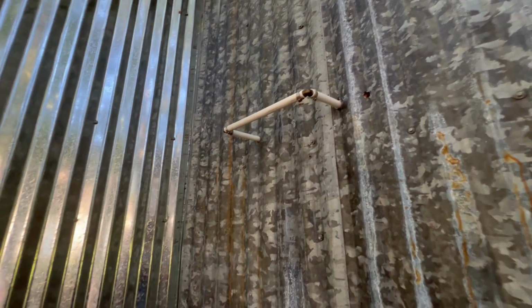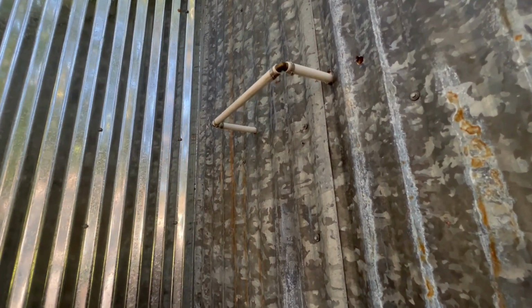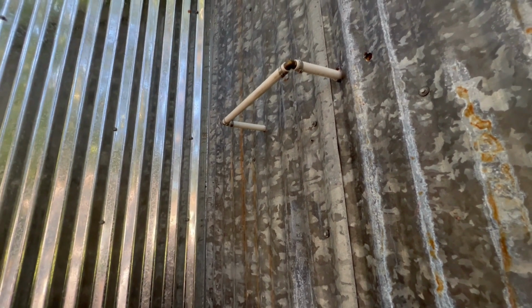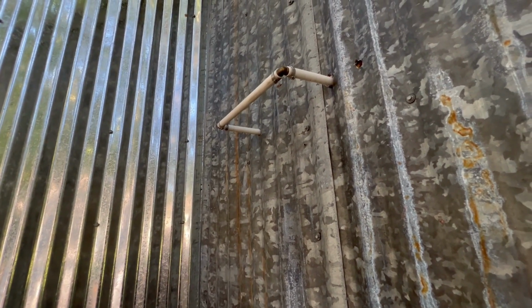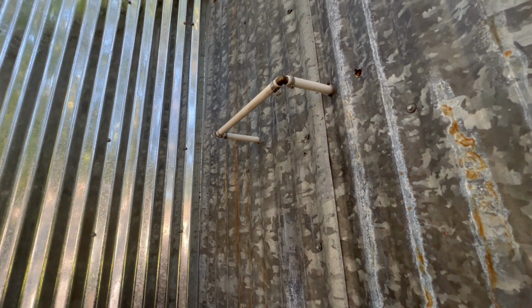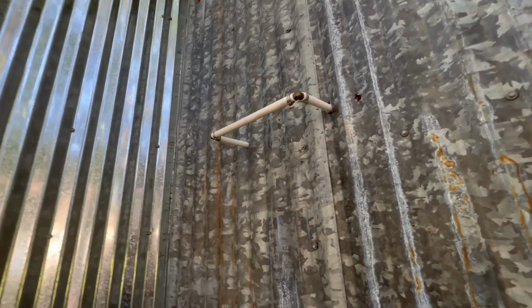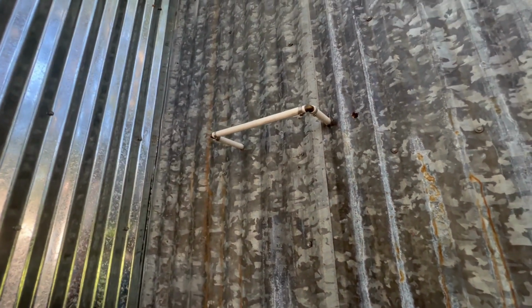And the plumber forgot that he had made this loop on the outside of the bathroom when I was pressure testing the PEX tubing in the walls. This is where the future shower is going to go. So since we had a loop, we had no pressure differential and we had no hot water. And I figured it out. I separated these 2 pipes and everything's lovely.